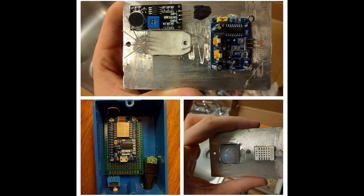Next, the motion sensor — and this is where the saga begins. From the beginning I've always wanted a passive infrared motion detector on the sensor node. It lets you easily detect motion in a room with really low power and supposedly very reliable. However, after I built my first version of the sensor node over a year ago, that PIR sensor has been nothing but trouble. The sensor would just sporadically go nuts — sometimes detecting motion every three seconds for six-hour intervals, or you'd get a random motion event when nothing happened, or the pin would just pull high and say motion detected with nothing happening.